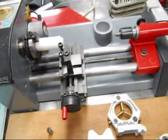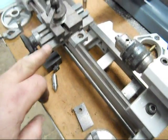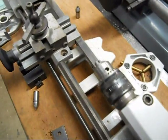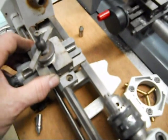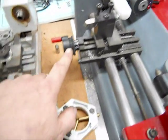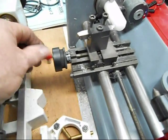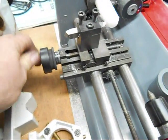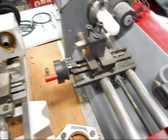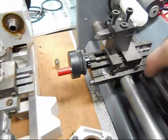The PC will handle a lot larger diameter. The Unimat 3 has a ZAMAC — which is zinc — or an aluminum die-cast cross slide, which is sufficient but not particularly rigid, and it's quite a bit smaller. The hand wheel is also smaller than the Unimat PC's. The PC's casting is all cast iron, making it a much more sturdy and rigid system between the tool and the bed ways.